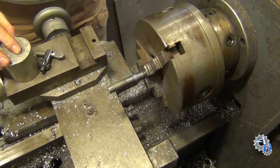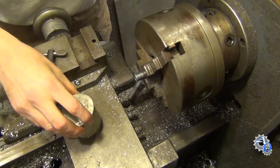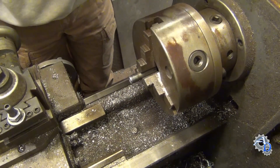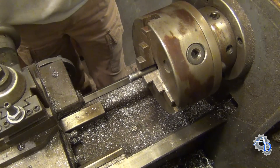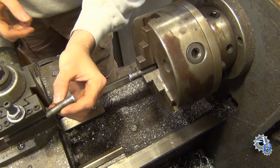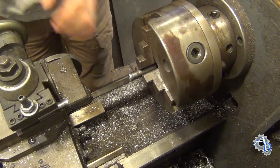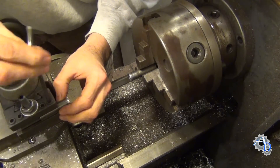Okay, well — that welded. I don't know how strong it is... not very strong. Okay, that first attempt — it did bond a little bit, but it wasn't strong at all. I really can't stop this lathe real quick. I'm going to try a lower speed and a more rigid setup. I'm going to actually mount this other piece in the tool holder here, hopefully without getting the chattering I got last time.